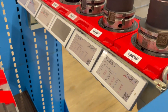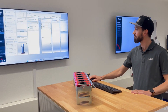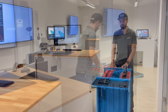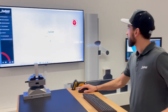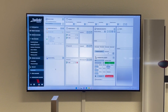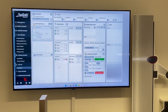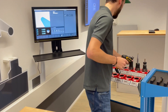Ruedi has now completed the setup process and can start at the next station. With the tool trolley he makes his way to the presetting. Here, he first logs on to the TopSolid Shop Floor terminal. All information for tool presetting is now visible and available, digital and paperless. Not only Ruedi's list of requirements but also the global tool requirements can be seen here. The color code shows the current status and the necessary actions. By selecting his specific program, he filters the list for his direct tasks.